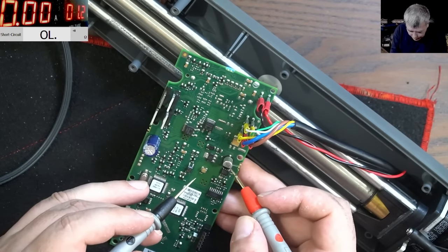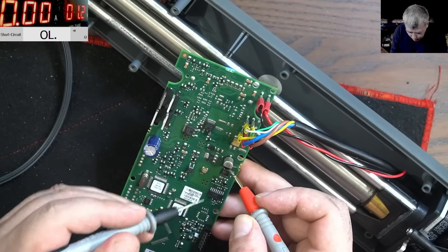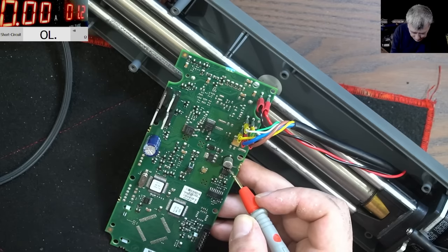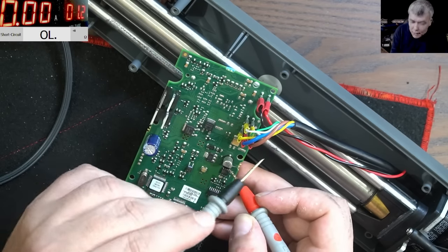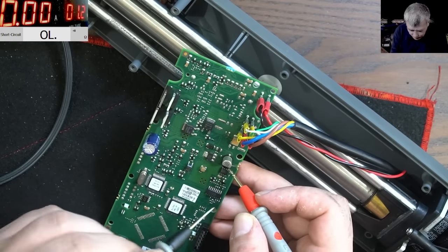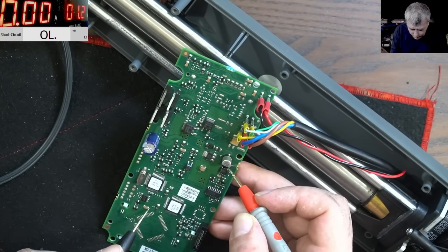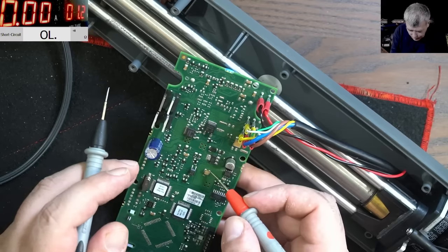Okay, let's see the minus of this capacitor. Actually, it's going anywhere. Yeah, it's going here. So I suppose this is ground, yeah? This is ground. Clearly, this is ground, doesn't matter what the wires are saying. I can see here a common point. So this is ground.